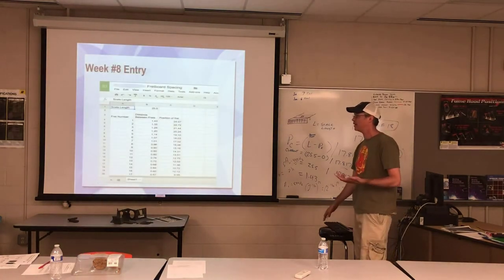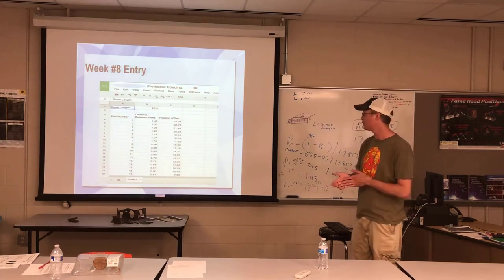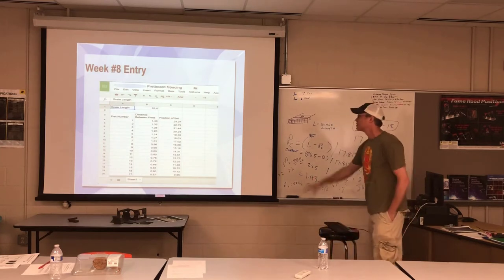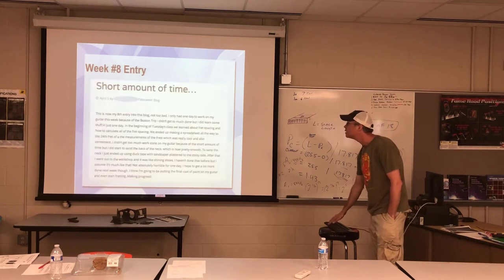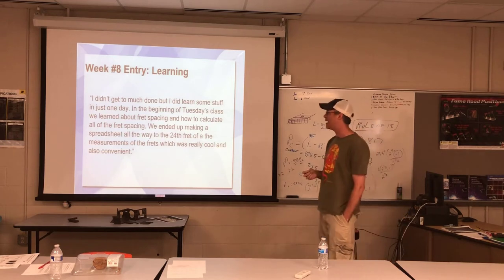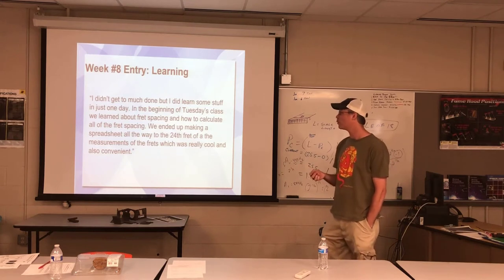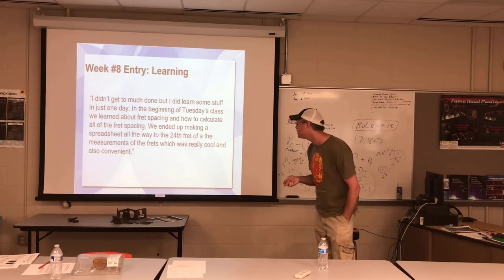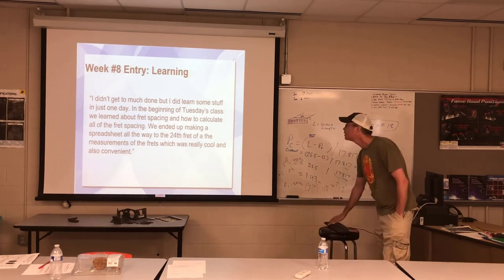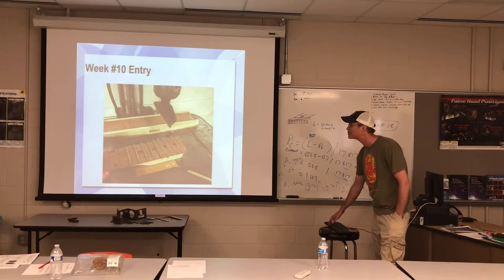So these students are just writing about what they experienced during the week. On this particular week here, we did a little bit more classroom time and not as much building. This is that spreadsheet activity that we were talking about the other day. So this is a screenshot from the student's blog entry. I didn't get too much done, but I did learn some stuff in just one day. In the beginning of Tuesday's class, we learned about fret spacing and how to calculate all of the fret spacing. We ended up making a spreadsheet all the way to the 24th fret of the measurements, a few typos there, of the frets, which was really cool and also convenient. And pressing frets. You guys just experienced this magic yesterday.